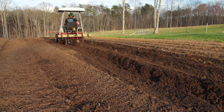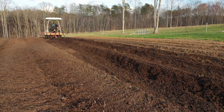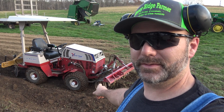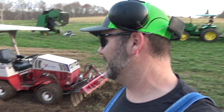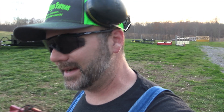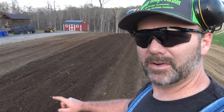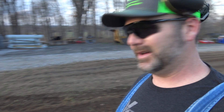Let's talk about articulating tractors. You might have been able to see from the drone footage that I kind of lagged a little bit. The way this tractor moves, the wheels don't turn - it articulates in the middle, meaning the whole front end moves side to side. That poses a little bit of a challenge when it comes to plowing a straight row. You can see some of the new rows I've bedded up have become wavy. One of the downsides to an articulating tractor is that it will wag - when you turn the steering wheel the rear end goes one way or the other.